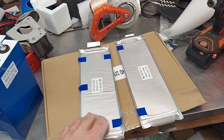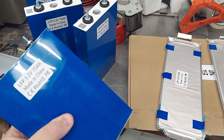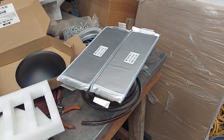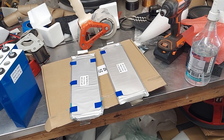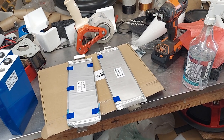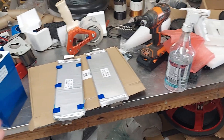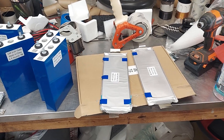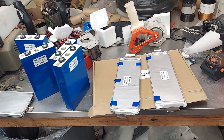This one just looks like an acrylic case — it's pretty sturdy, you really don't have to do much more than this, no need for metal or anything. They were out of the 30-amp BMS, so I looked on eBay and Amazon and you can get a little 30-amp BMS for like 17 bucks. You do that for this bank, put all the banks together in parallel, and they charge and discharge. Just make sure you get the right one.